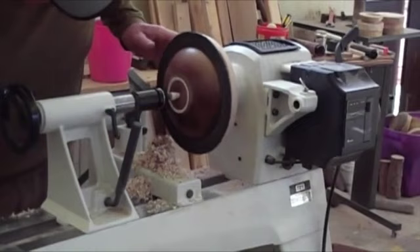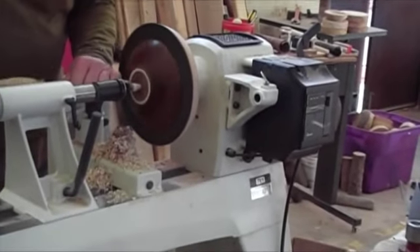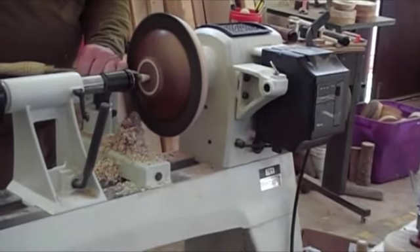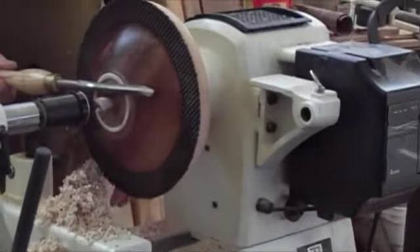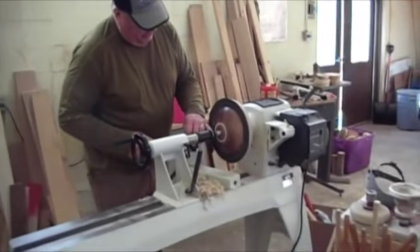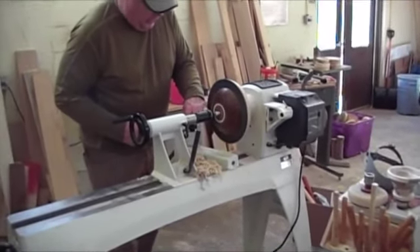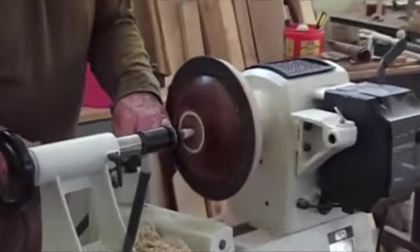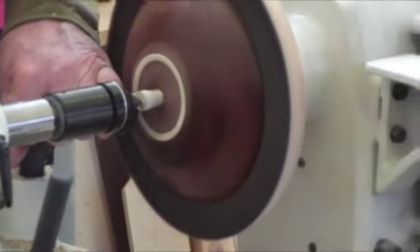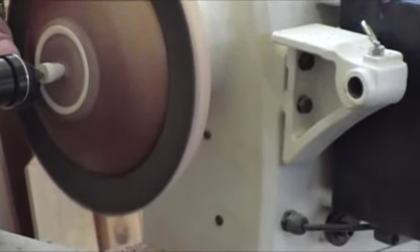It's getting closer, just a little bit off. I'm not going to worry about it too much. I just want to make sure I've got clearance so it sits on the table — that center's not going to make it wobble. She'll take something like this and run a 64th of an inch piece across there, and when she's done it's smoother than that. She is very good. So when you get right down to that last little piece, this is a good gouge to have. It scrapes well and cuts really well with that particular grind. I don't actually grind this at all — I just sharpen it on the stone.